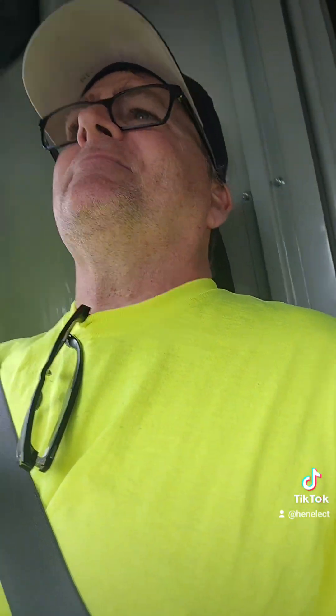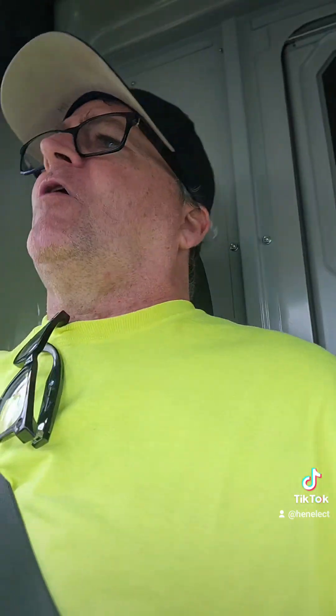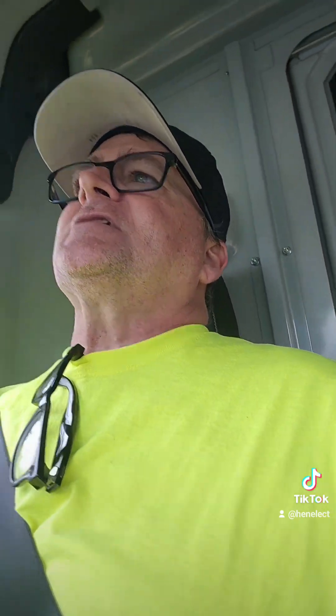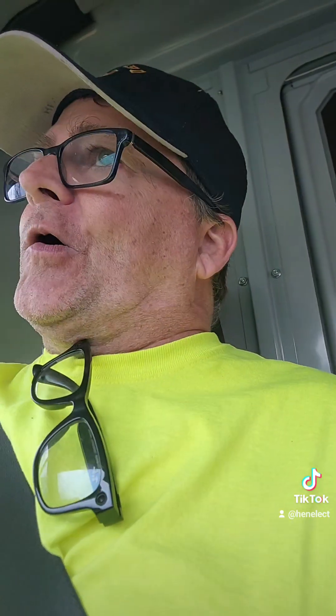I'm thinking I'm going to change the light bulb, put the bulb into the jelly jar fixture. The light switch is right there next to the sliding door. I couldn't believe it — maybe the bulb is bad. I go check the bulb, put new bulb in, no light. Take the fixture down, I measure — no power. Sometimes the little tab in the Edison base, I thought maybe if I take a screwdriver and pry down on the tab that will make contact with the bulb. It wasn't. So I put the fixture back, realized I got no power, go to the switch, open up the cover, put my non-contact in — no power on the load side.